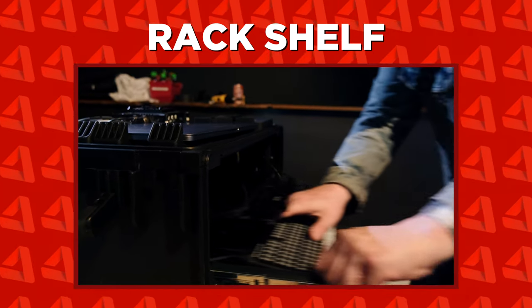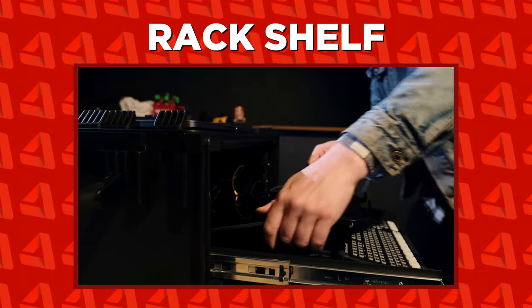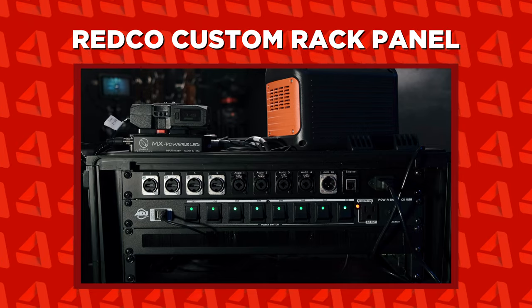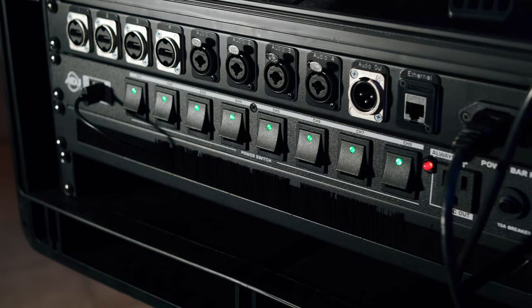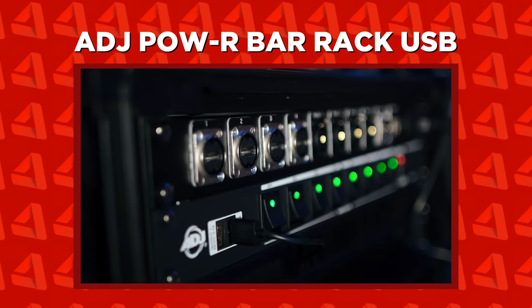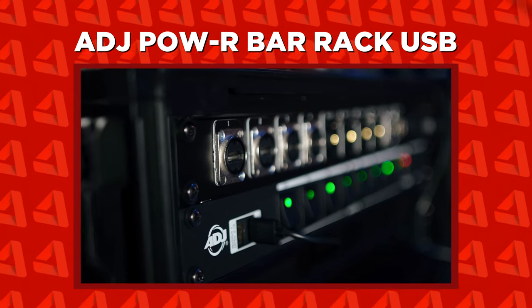In addition to all the gear, we also have a bunch of hardware that goes into the live streaming box. We have a standard rack shelf that we use. You can get a range of these online. I would just find one that's at a good price and make sure it's durable and sturdy. In the back, we have a custom rack panel. It has 4 HDMI inputs, 4 XLR inputs, 1 XLR output, an Ethernet input, and power. And it's really great. To power this thing, we have an American DJ power rack USB. I wanted to make sure I got something with 2 USB outputs because, as we know, that's just becoming more and more common. So having them built into the rack was kind of a must for me.